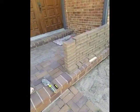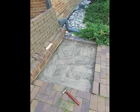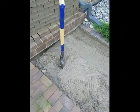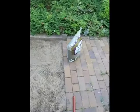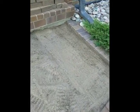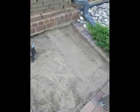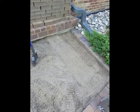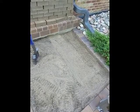So this is my wall of bricks, and when we're done here we will put down the dirt and sand and then start pounding them down. We have all the bricks removed that we want to do right now, and we are going to put some paver gravel — paver base is what it's called — down. You can see I've kind of dug out a few inches, and I actually took a shovel to get it to go a little bit lower. You just want your base to be gravel, and then you're going to put your sand on top of that — it's for drainage and also for shifting, so that you have something kind of firm for the bricks to sit on.